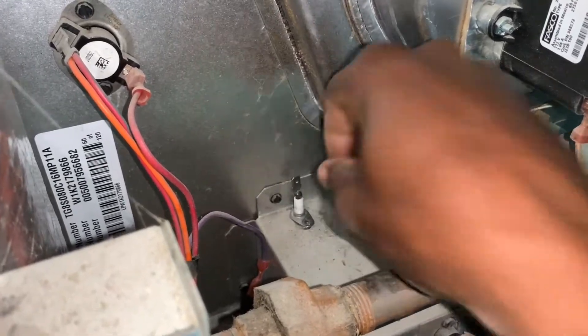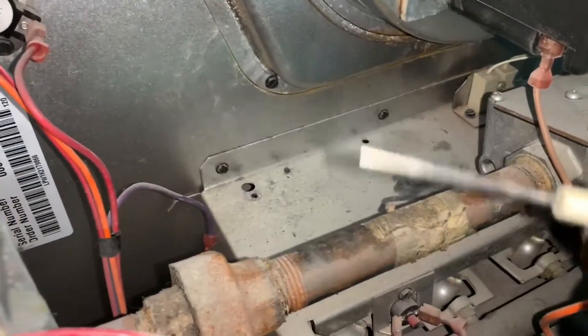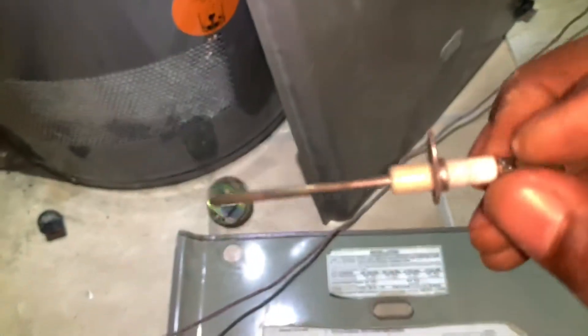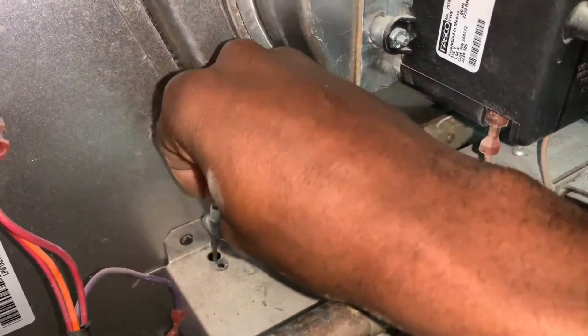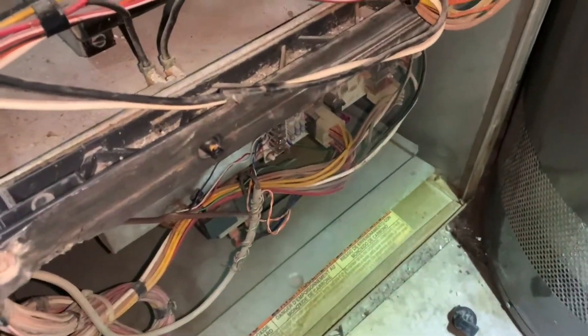This is not for do-it-yourselfers. This is a flame sensor right here, simple as that. I already cleaned this one — it's starting to look a little dirty already, so I'm going to replace it eventually, but for now to get this unit going I cleaned it and that seems to do the trick. It came back online, so I'm going to reinstall it. As a matter of fact I'm going to fire up the furnace — it is calling for heat — and I'll push in the door switch right here.